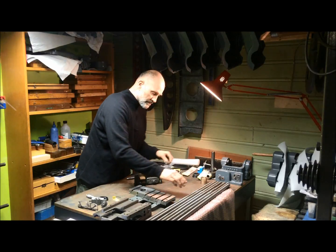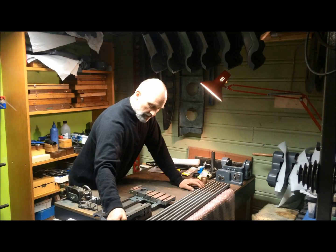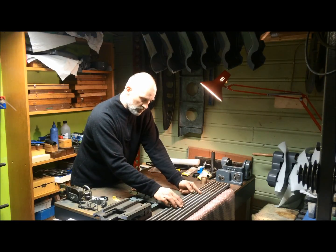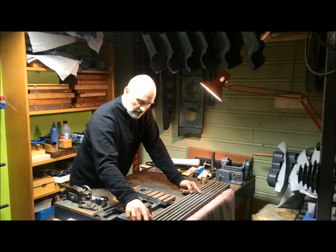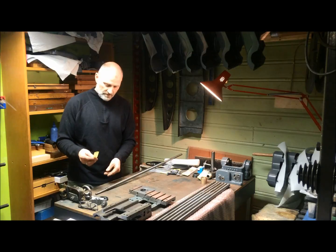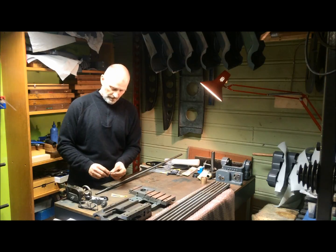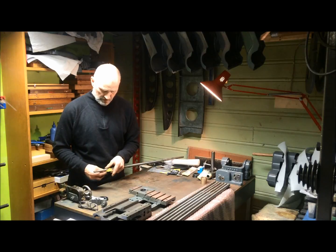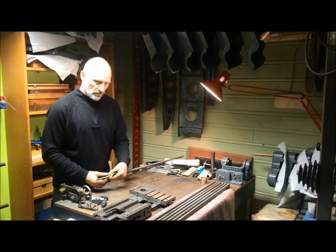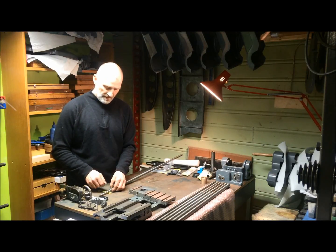The lead screws themselves are also in need of attention. I have to test them for wear, which would mean comparing the most worn area to the reference area over here. To do that, I thought I would cheat a bit because I don't have any test equipment specific for that — take a suitable small drill and mimic the test that you would do when you have proper pins. I only care about the measurement against the reference here.